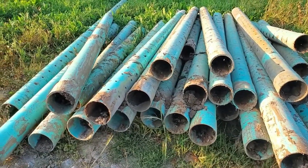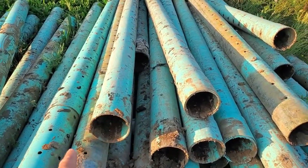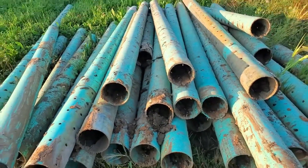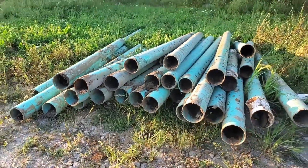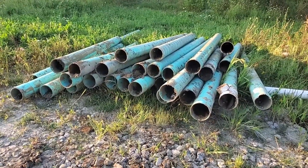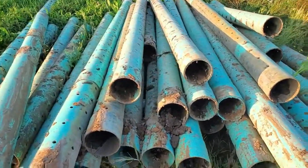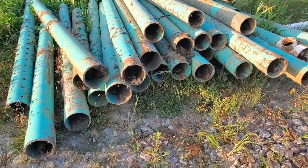This big bad six-inch French drain system is done. We like corrugated pipe because it has holes all the way around it — 360 degrees — it can take water in from all around the pipe. We also like using a non-woven geotextile filter fabric that's double punched so we don't have sediment in our pipe. We also don't believe in putting our pipe on a bed of stone, because that bed just holds water, and tree roots and iron ochre are going to grow in it.